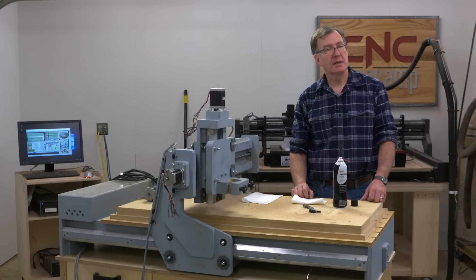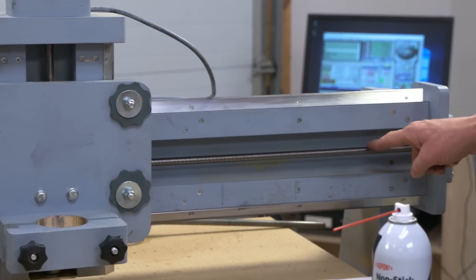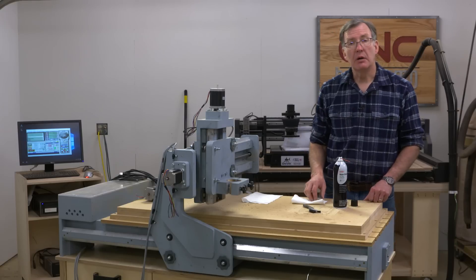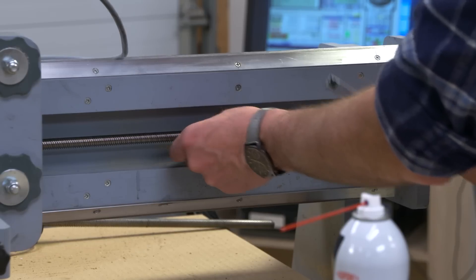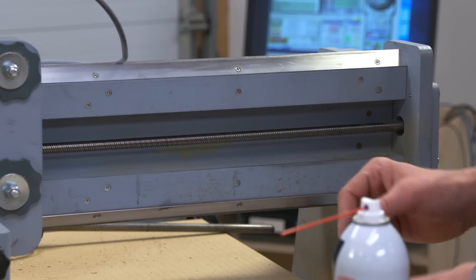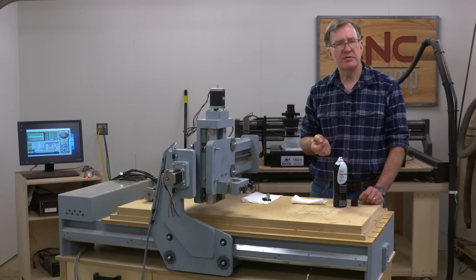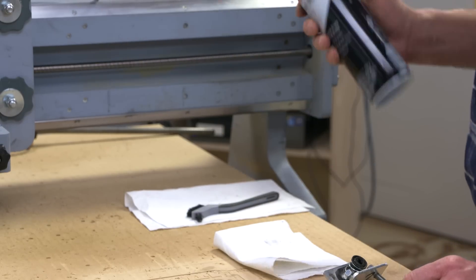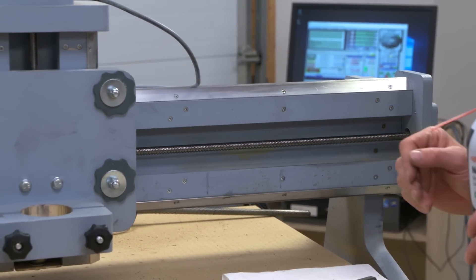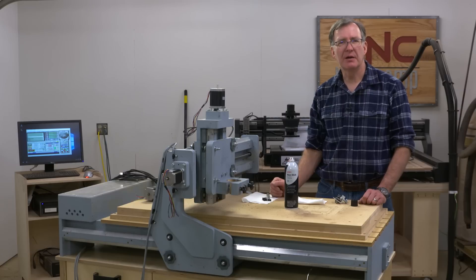Another mechanical element we need to care for are the lead screws — there's a lead screw for the Z-axis, the Y-axis, and running underneath the machine is a lead screw for the X-axis. Take a little time to clean them with a soft brush, moving things several times to get them to rotate. Once all the dust is off the lead screws and they're clean, we want to apply a dry lubricant. It's important that we don't use oils because they'll attract more dirt. This one happens to be Teflon-based. I'll put a small spray along the whole length of each lead screw. The X lead screw is a little harder to get to, so you'll need to prop the router up just a little bit.